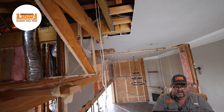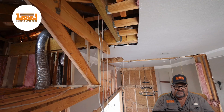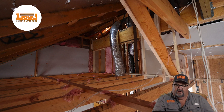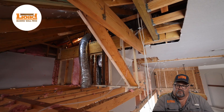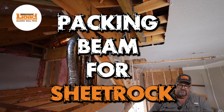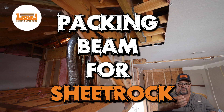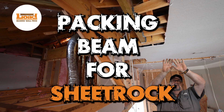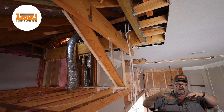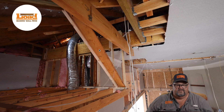Here's a good look at the work we did in the attic. You can see this beam going across — it originates on this corner and comes all the way across, and right here is the load from below that we're hanging. A strap in our world can mean a sheet of plywood we use to nail the whole thing together. So this beam goes all the way across to the exterior wall, and the load that was on that center column is now hanging. We have a beam across the top, then hanging straight down we tie in — and that is what is holding up the corner of the ceiling.